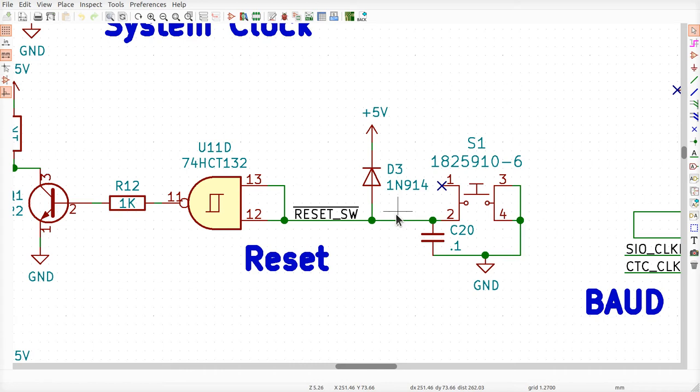Now, that's going to last almost zero time, because this one little tiny capacitor would be powering the entire circuit. But the point is, this diode will bleed off any charge instantly and not allow the charge from this capacitor to burn up the gate's input pins, okay? That's what this diode's doing.